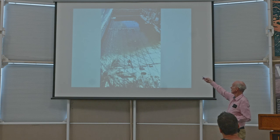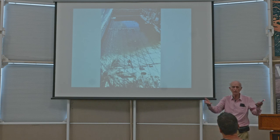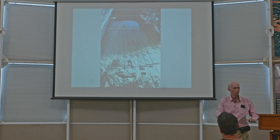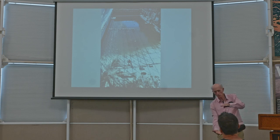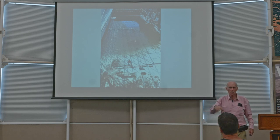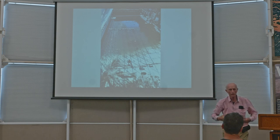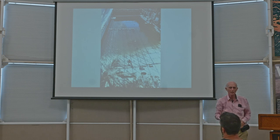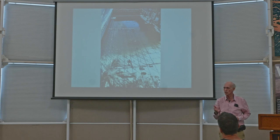Well, one of the things we needed was waves in the ocean, so that there'd be natural action of waves. And there's a big chamber back there in the back. Underneath the water, which you can't see, there's the open mouth all the way across the ocean. It's about this big and all the way across, 60 feet wide. And in the chamber, we were sucking a vacuum. That would suck water in the mouth and up in the chamber, and then momentarily release the vacuum, so the water is no longer being sucked up, and it would fall down and surge out the mouth. That's how the waves in the ocean were created without using pumps.